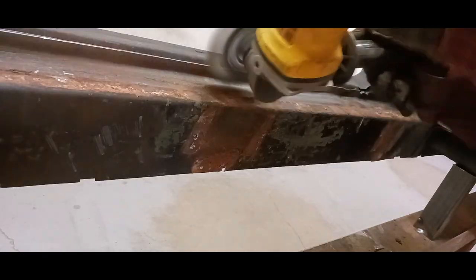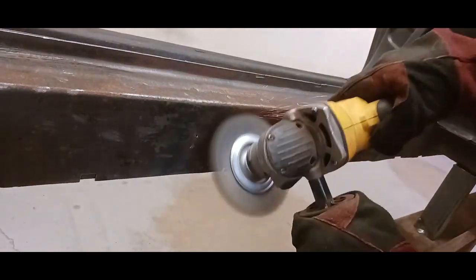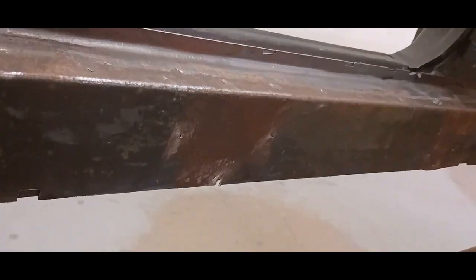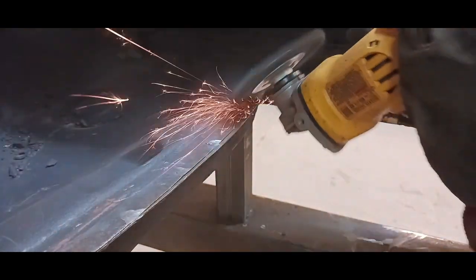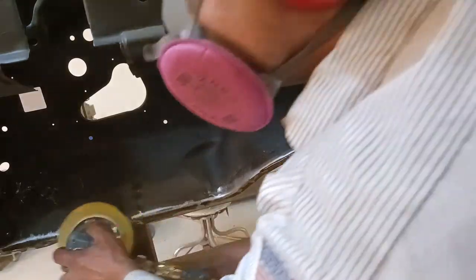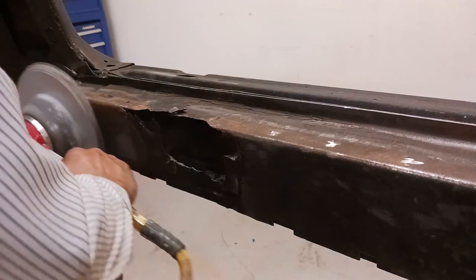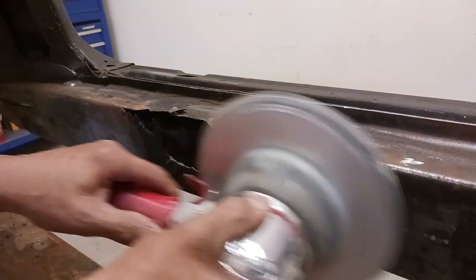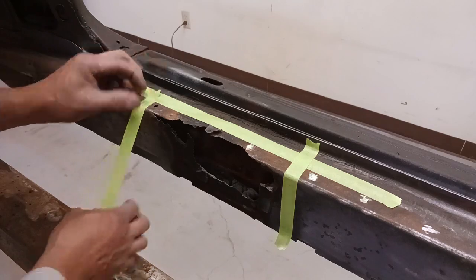You can see the areas we're going to be repairing. This is the leading edge of the floor pan. Now we're going to use a wire wheel and get this area cleaned up — remove any rust scale or as much undercoating as we possibly can and get the surface really nice and clean. Then we're going to start prepping the area, because before we sandwich these parts together and weld them back, we are going to apply a coating — either weld-through primer or POR-15. But first we're going to repair this inner rocker.